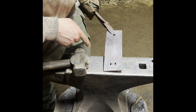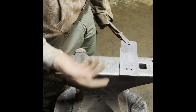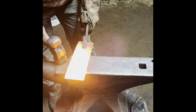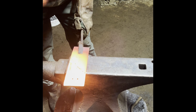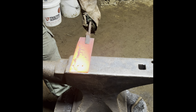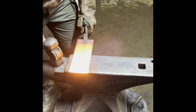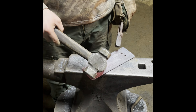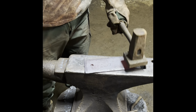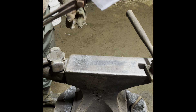As you can see I got those slots punched out. Now I'm just going to go ahead and chamfer the whole thing and then we'll work on the knocker. The knocker is going to be pretty simple — it's just going to have two opposing scrolls and then bend into an S-shape just like the other one. I'm going to chamfer the edges here, then take a flatter and make sure it's nice and flat. And now I've got a nice chamfered back T-shape.